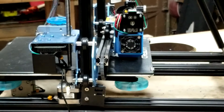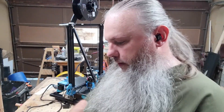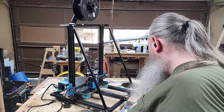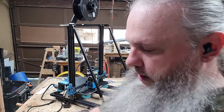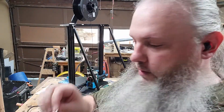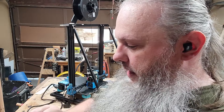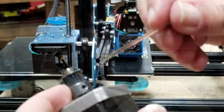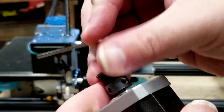That little pulley is held together by several Allen key nuts, and I am using the provided Creality Allen wrench. I am going to loosen them — as you can see there are two of them.